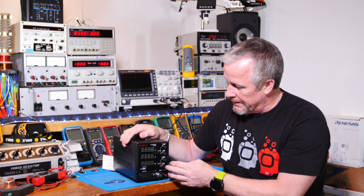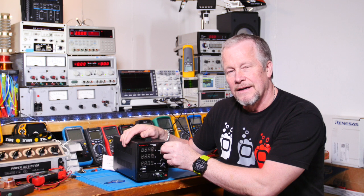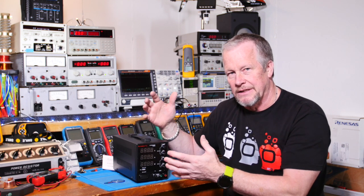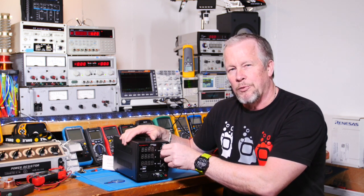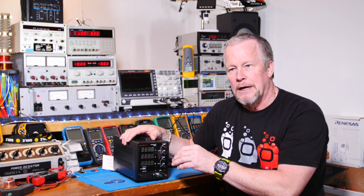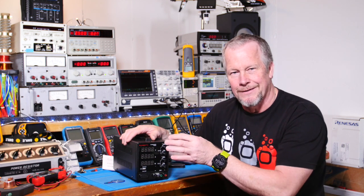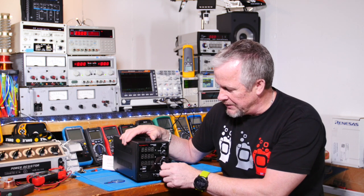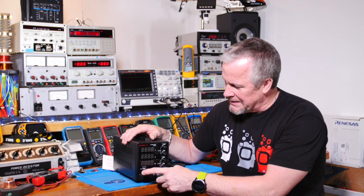Well, the thing you get with this one is you get both on your voltage and your current a coarse adjustment and a fine adjustment. So supposedly it's a precision power supply. We'll find out if that is. The fine one takes you, I think, up to 1.8 volts change. That's kind of nice. Sometimes they don't change enough, and if they change too much, then they're not fine enough, right? 1.8 is about 5% of the full range, roughly. The current is 0.45 amps, so almost a half an amp range on 10 amps, again about 5%. And then also it has this USB output.